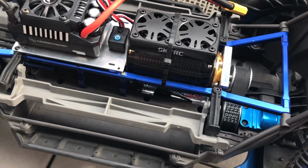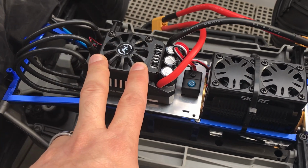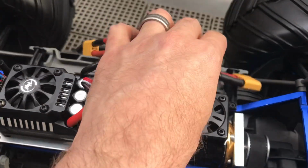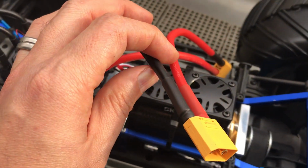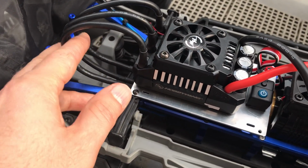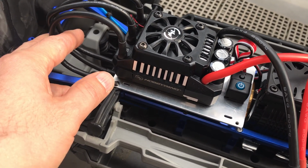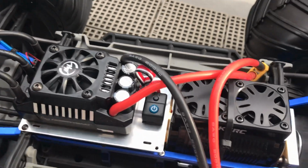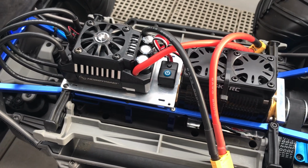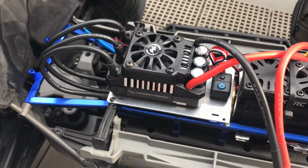I did want to mention, guys, if you're gonna use the Max 5, buy it on AliExpress. I will leave you guys a link in my description. The folks that sold it to me, I forgot their name, they will solder any connectors you want, okay? 150s, XT90s, whatever. And they even asked me what connectors I wanted for these extensions. So they put 6.5 millimeter bullet female to male connectors, because I soldered the male connectors to my TP motor, and it was plug and play, guys. I didn't have to do anything but plug it in. And the measurement of the cables and the wiring was perfect.